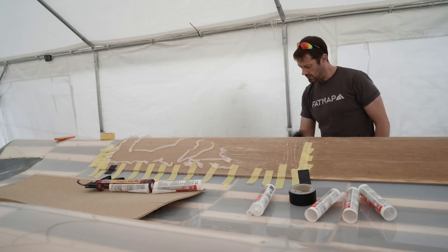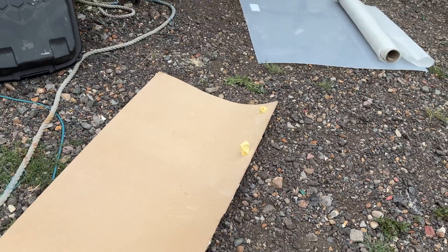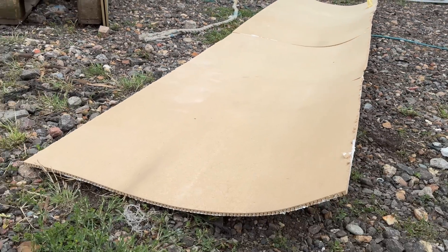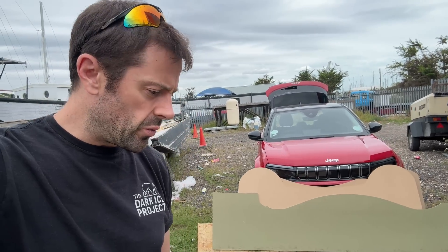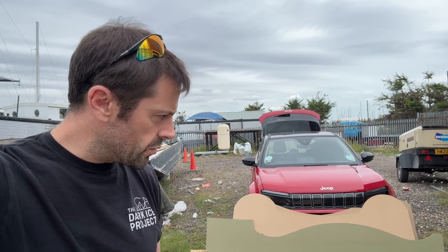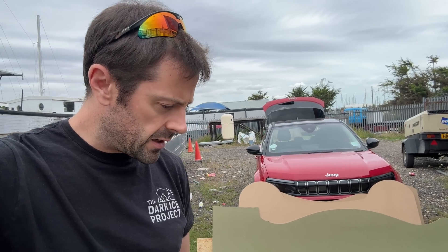You saw me try to construct the scored MDF and mastic thermoforming mould in the previous episode. Sounds grand — it is grand. And here it is, upside down on the ground. It could have worked better. It hasn't fully held the shape, and although the silicon and the white sealant has stabilised it a bit, we're going to have to use guides underneath to give it a much more resilient shape. Never mind, it was only cheap.